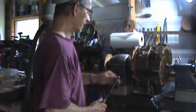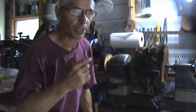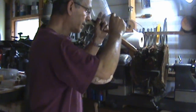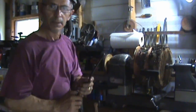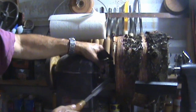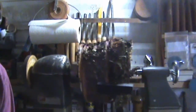I'm going to start this up. Follow some safety precautions — I wear glasses for sight, but definitely wear face shields during any roughing that you're doing, and try to stand out of the way. I have it locked up between centers, put in so it makes good contact with the end of the log — it's locked in place and I brought my tailstock in as tight as I could.